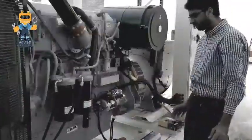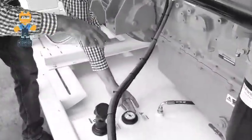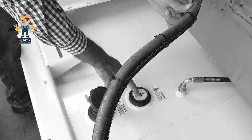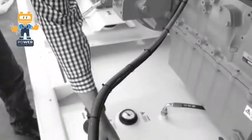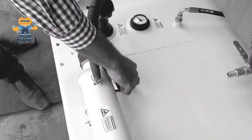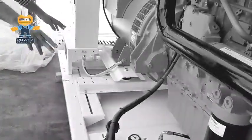After connecting the batteries, we also have to check the diesel level — how much diesel we have in the diesel tank. Before starting, this is very important. This indicator is here showing the diesel level. As you see, it shows one fourth of the tank, half of the tank, three quarters of the tank, and here it is full. Also, there is a digital sensor for fuel level. This sensor gives you a reading of what percentage of fuel is available in the fuel tank — the base tank. This entire area under the generator is the base tank.